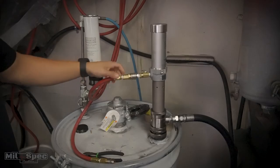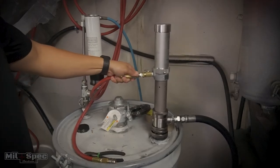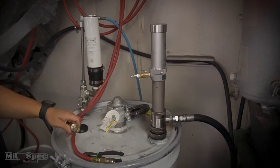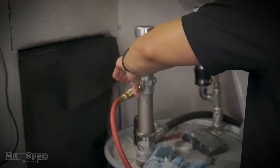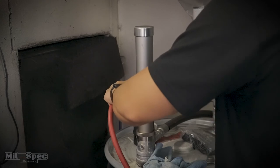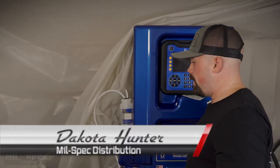I also suggest coming over to the stick pumps — we've already unhooked the agitator line. I like to go ahead and unhook the stick pump air lines as well, so that tomorrow morning you remember to put air tool oil in there again. We always want to make sure we're doing that to help the longevity of your equipment. At that point you are good to go for the day. Thanks for tuning in — if you have any comments or suggestions on things you do in your system, please let us know.